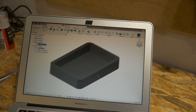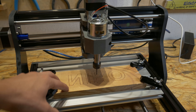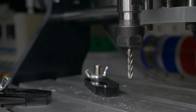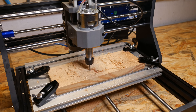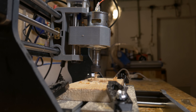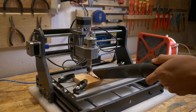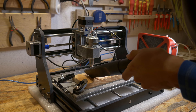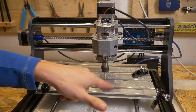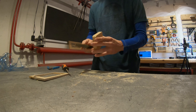For demonstration I'll use my simple tray model and the same piece of wood, with a 3.175mm (1/8-inch) 4-flute milling bit. The sound of the machine, even with light settings, is quite terrifying — the whole machine vibrates a lot and is definitely noisy. Separating it from the table with foam or rubber is a great idea. Don't expect it to be super efficient at cutting harder woods, and with proper settings you should be able to cut most wood types. It's not a production machine — it's targeted for learning on a budget.